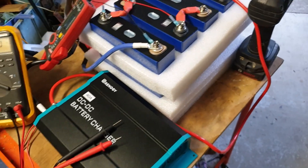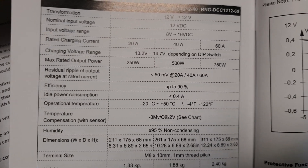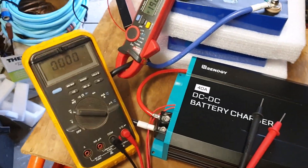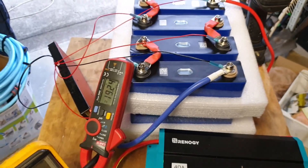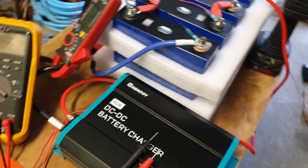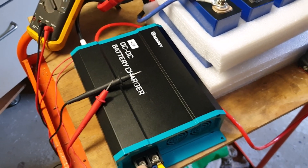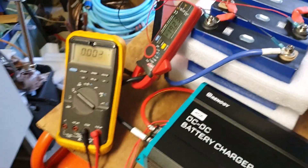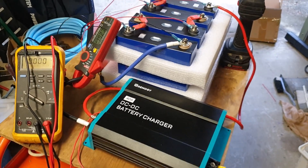As long as you've got more than 9.5V here — the spec says 8 to 16 volts input — you will get an output. It might not be the full output, but it works over that entire range. They quote the same range for the DCC50S, but it just doesn't do it — that was the whole point of my video. The DCC50S will not do that unless you have massive cable at the input, giving you no more than one volt of drop. This works properly. The DCC50S doesn't. That's my point. I'll get on with building my DC system in the caravan — thanks for watching.